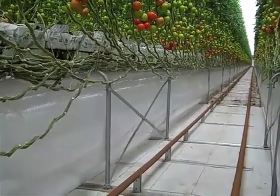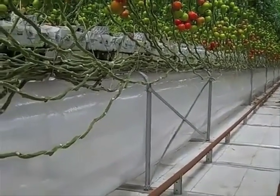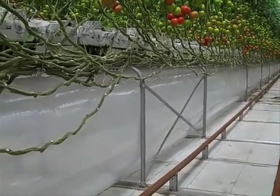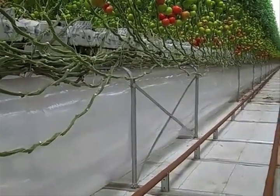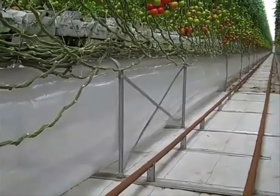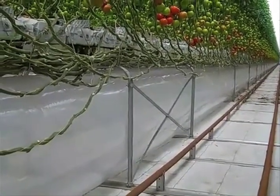It's a semi-closed system, and we're cooling this greenhouse with the help of fans instead of our regular roof windows. What you can see here is the newest technique we're using. Instead of regular roof windows, we use fans in this greenhouse, and those fans are in fan boxes. On those boxes there are tubes connected with holes in them, and through those holes the air gets distributed evenly through the greenhouse.